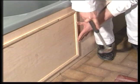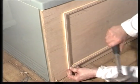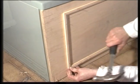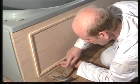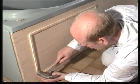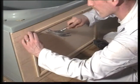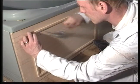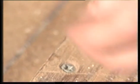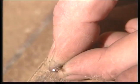Repeat the same process on the left-hand side of the panel. When you are satisfied that the beading is positioned correctly, the nails can be hammered in completely. To stop the timber from splitting, it is advisable to flatten the point off with your hammer.